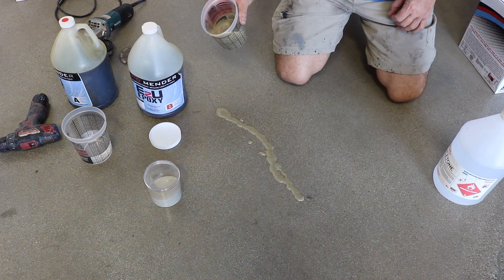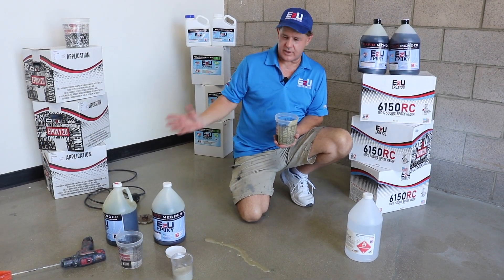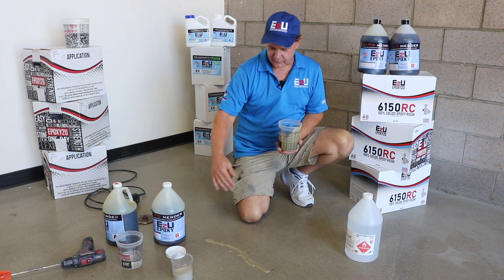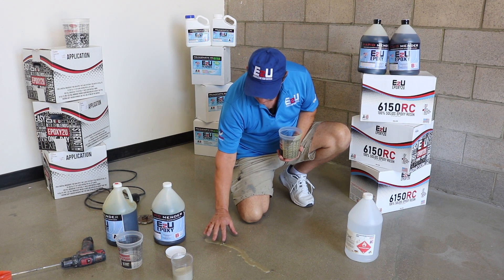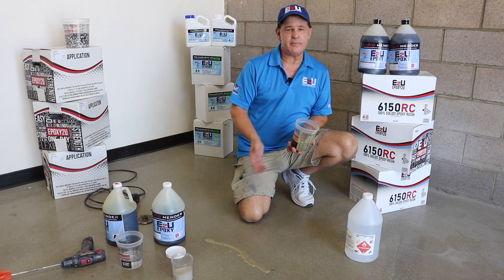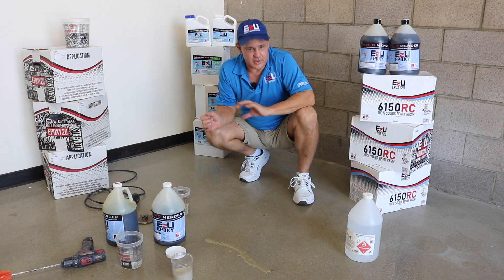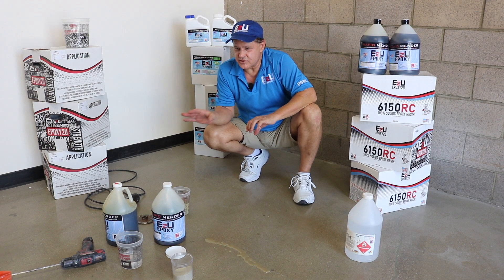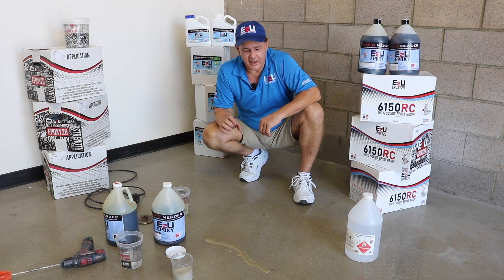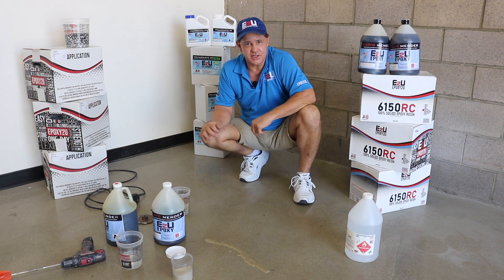It's that quick and simple. I usually don't over-pour that much but it was a tight crack. We never want to mix up more than we can apply in about two to three minutes because this is designed to be quick. It'll fill in all the cavern — I did overflow it a little bit just to make sure it got in completely. In about 20 minutes or less this will be ready to grind, so it really doesn't delay you on your job. You can come in, fix your cracks, fix your spalls, fill in joints — it'll get very hard and very solid and will leave you with a virtually seamless transition where you will not see your cracks.